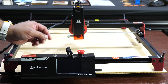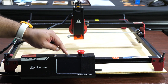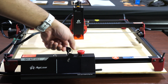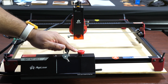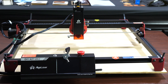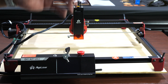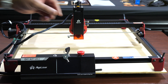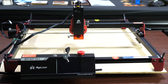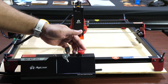On the front of the screen you have the power button, a set of safety keys to lock and unlock the machine, and an emergency stop button. If something goes awry during laser cutting or engraving, push the emergency stop down to halt everything. To disengage it, you have to twist it — it's not a simple press-and-release button. If left engaged, every time you turn on the laser engraver it will show an exclamation point and beep constantly, so make sure to twist it back up after use.